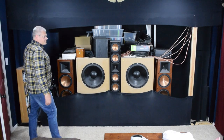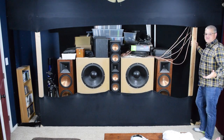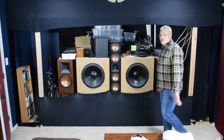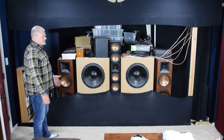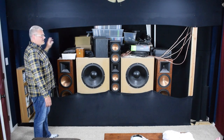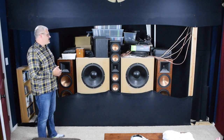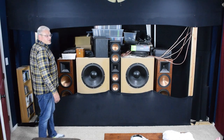I just have some screws holding it against the wall, and then two cross-members coming down here on either side. As you saw when I took the screen down, that's how the screen actually mounts to the wall. It's nothing too awfully complex. You just need to get some studs, square it off, put a couple cross-members, and then you can mount your screen to it.